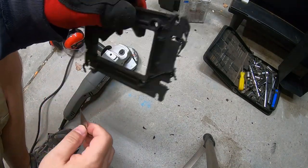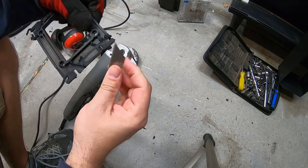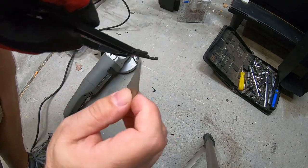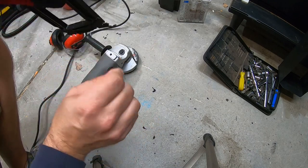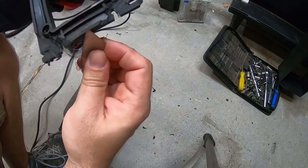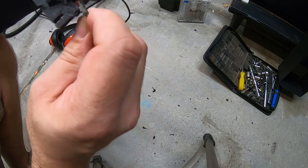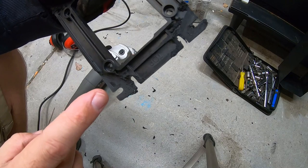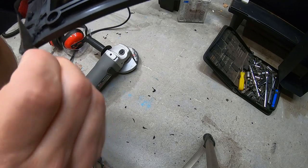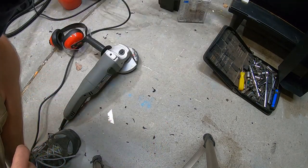That was kind of a pain. You can see how it's a lot thinner now. I'm just going to clear all these burrs off with some razor blades — we want to clean this area up. The beauty of this part is no one is going to see this piece, so not to worry. I could probably go a little bit more right there. We just needed it to be thinner so we can put the bolts on. Now I'm going to go find some bolts and we'll put it all back together.